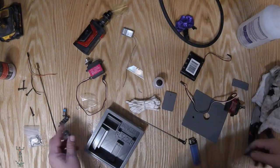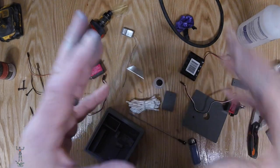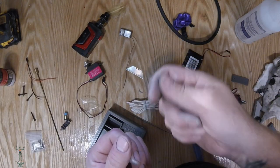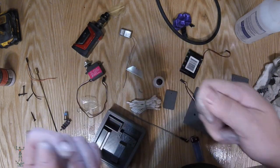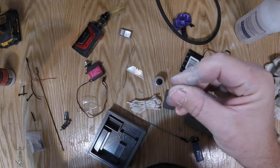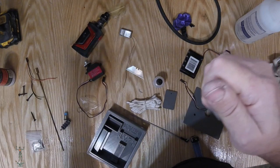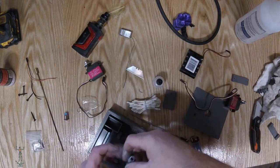What the grease does inside there — it keeps it from cracking down the road, and it also allows everything to move nice and smooth. Because if your bellows or boot is dry and you move your rudder shaft all the way out, it'll stretch your bellows and sometimes pull it inside out, or pull it so tight it'll break. This keeps that from happening.